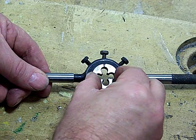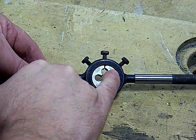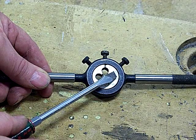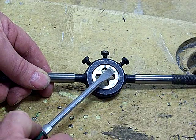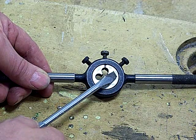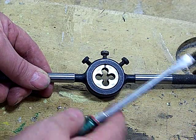It fits into there and you always put it in so you can see the actual size. Look carefully: M8 times 1.25 — so it's giving you the outside diameter of the bolt, and 1.25 is the pitch of the screw thread. Now when you first put it in, what we do is we tighten the center screw.